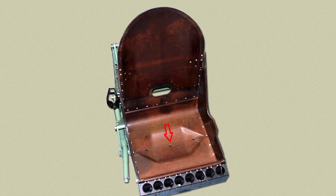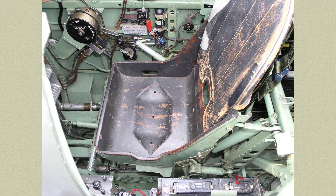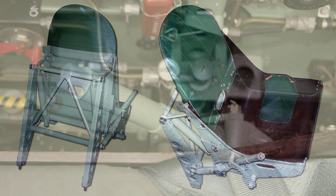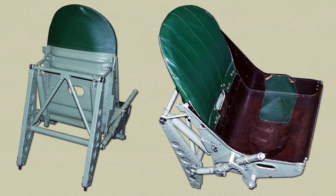The seat is attached to the mounting by four links, the two lower links being joined together by a cross shaft which passes through bearings at the bottom of the seat. The lower links are pivoted on the ends of the lower cross tube of the seat mounting, and the upper links — of which the port one is adjustable — are pivoted at the top of the mounting. The starboard lower link forms part of the operating handle by means of which the seat is raised or lowered. This handle contains in its end a spring-loaded plunger attached to a rod inside the handle and joined to a pin which projects through each side of the handle. The handle moves between two quadrants attached to the seat and engages in any one of six notches in the quadrant to lock the seat in the position desired by the pilot. The total vertical adjustment of the seat is four inches.